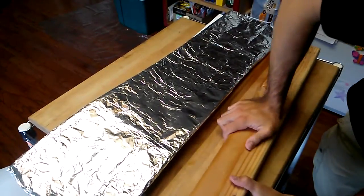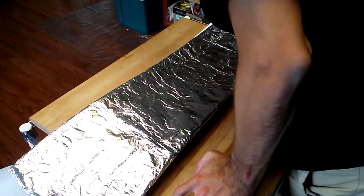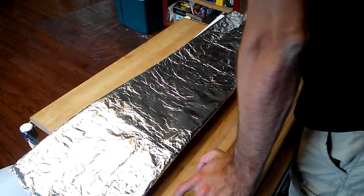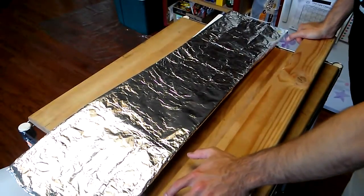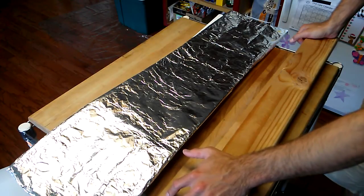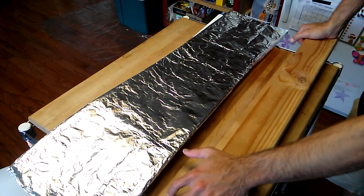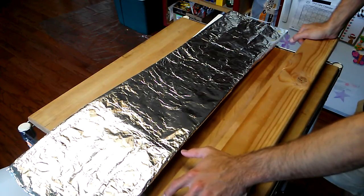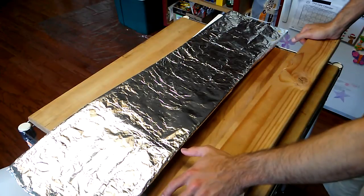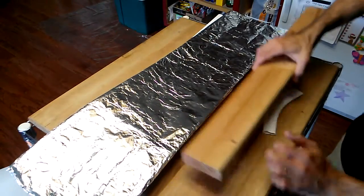The real trick is going to be how we get all of these pieces together. Basically I'm going to saw the backs so that they line up nice and straight, glue them together, then probably thin the ends and heat sections of the blade portion I'm making, and insert the ends into the blade portion. In other words, I'm going to put the outside of the back parts of the axe head into the inside of the front part.